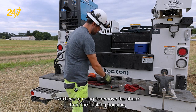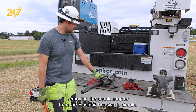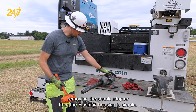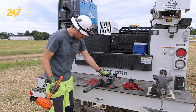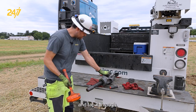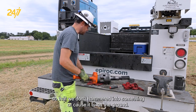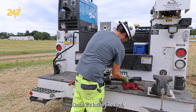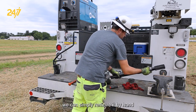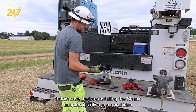Next, we're going to remove the shank from the flushing housing. Removing the shank adapter from the flushing housing is simple — we hold in place and tap it through. Be mindful of where the other end is going, so that we don't hammer it into something or cause it to fall on the ground. Once it's loose, we can simply remove it by hand, and from there we can get a new one or reuse this one.